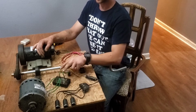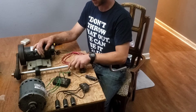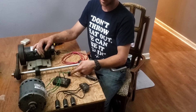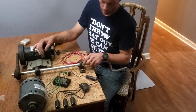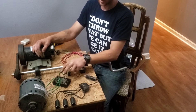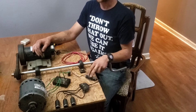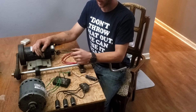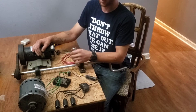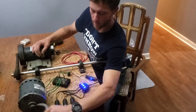This is nothing but a three-way bridge rectifier, so it takes three-phase power in and outputs direct current. This is just a tiny capacitor that helps smooth it out, but it's so small it really doesn't do a whole lot. All we do is take the three-phase power, convert it to DC, go through the little capacitor, and then go straight to where you'd plug it into your car. There's no voltage controller on here — this is just the bare minimum you have to have to power up and charge a device.